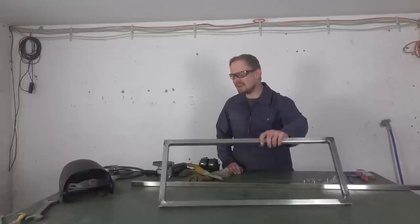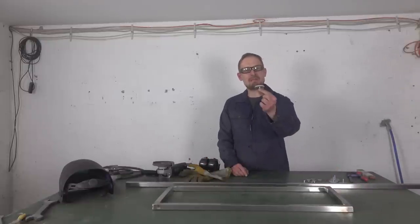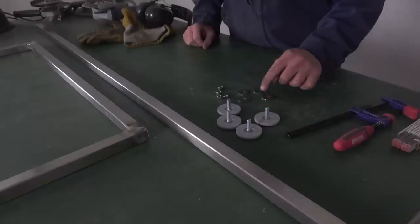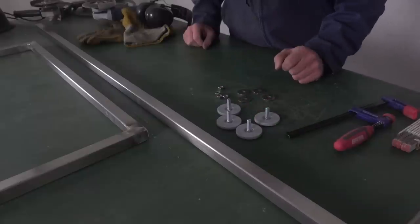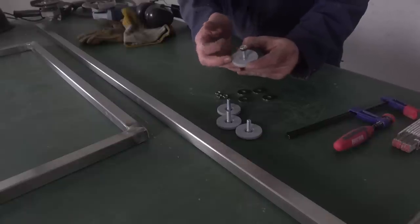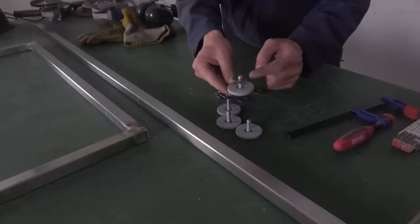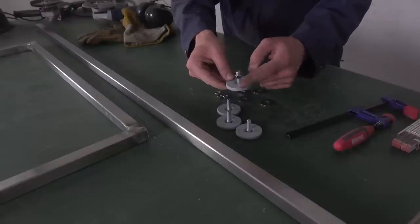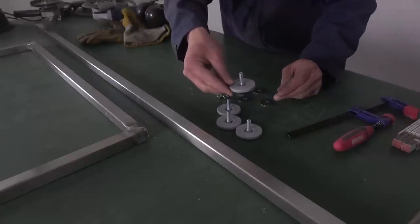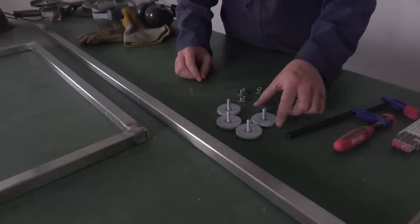The frame for the gastronomic containers is done and I can cut the legs for my table. I ordered four leveling knobs with stainless washers and stainless nuts. I will weld the washer to the nut, then weld the washer-and-nut assembly to the leg, so I can mount these knobs to my legs and adjust the table height for uneven floors. I cut all four legs to a length of 83 cm, and now I will weld the washers with the nuts to the legs.